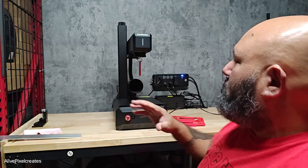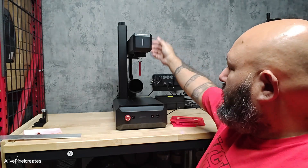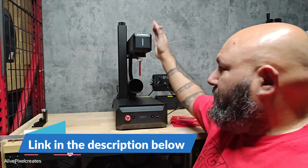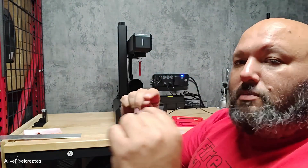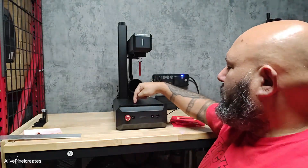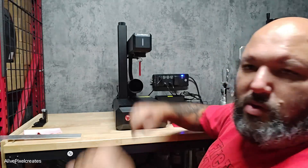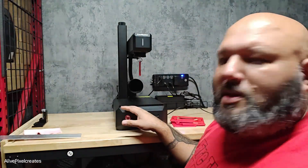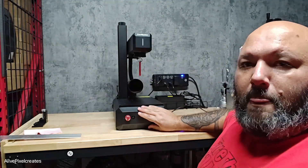Power is great. It's basically a couple of screws to assemble. You put the galvo unit on the L-shaped bracket they send, tie everything right, everything is on the bracket. Then the column goes on the base, and they have a little film that goes under the base so when you engrave, something that goes through the holes won't mark over the main unit — it's just protective. Then it's four screws to hold everything over the main unit.